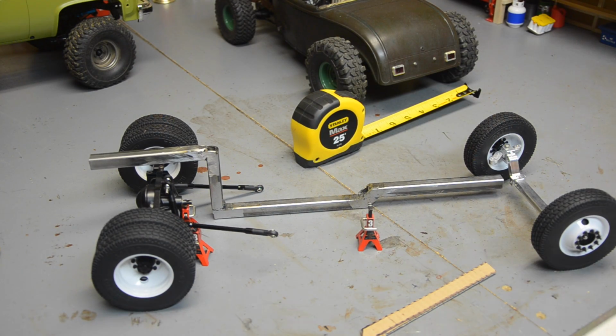So, if you've seen, I've been making my entire shop a mess, welding and grinding all this down. I've got my basic profile for the chassis welded up. And the idea that I had on this, to save time and to cure some of the issues that I had when I started my lowrider build trying to make two exact frame rails, is to make one rail and cut it in half. That way I have two even C-channeled chassis rails.